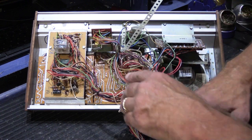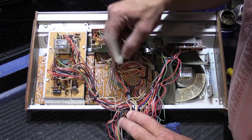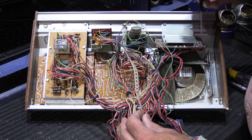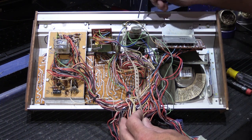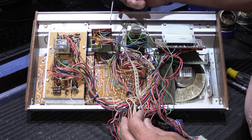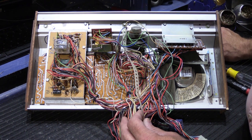So behind all the wires, we have a variety of other things. We have our typical 70s and 80s support strap, missing its hook, of course. Here we have the back side of the intercom control switches. Here's the back of our speaker cone, the one on the door that somebody didn't know how to open. Here's our volume control for the speaker cone. This is the intercom control board over here. This is a mechanical latching relay, which is what spins the disc with the numbers on it to tell you which FM station you're on.